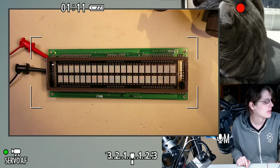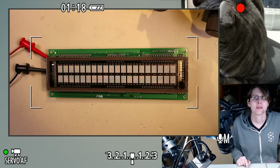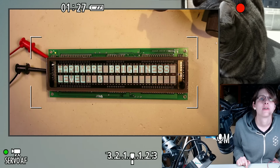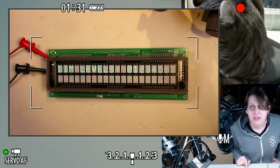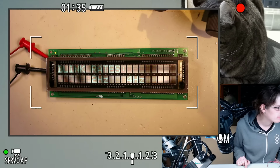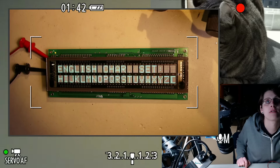It needs a little more. Okay, it's drawing. Try doing that without ramping up the current slowly because it hit the current limit. Oh, cool. It's identifying itself. It's going to look a little dim next to the bright lights that it's competing with, but it's actually pretty bright. It's drawing 0.63 amps. Let's turn some of this light off.